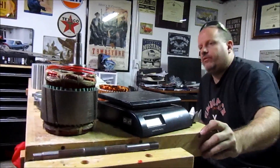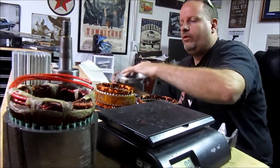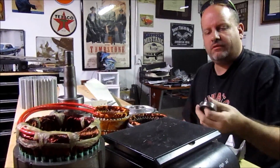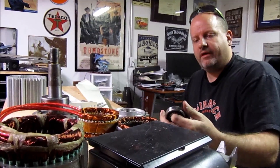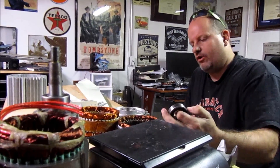When we look at the White Lightning generator components, one of the things you need to realize when you want a wind generator that's going to last is you need a big bearing. The bearing carries the front lateral load when you put a large blade set on a wind turbine. Hugh Piggott wrote an article way back talking about the lateral load and the failure of the 17 millimeter bearing.